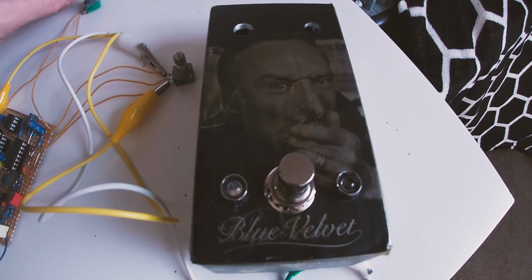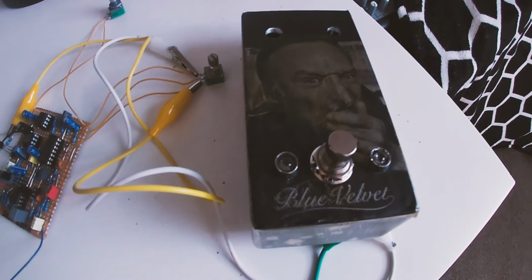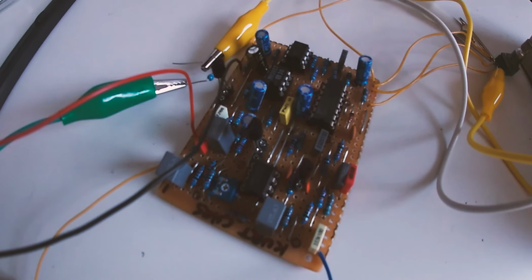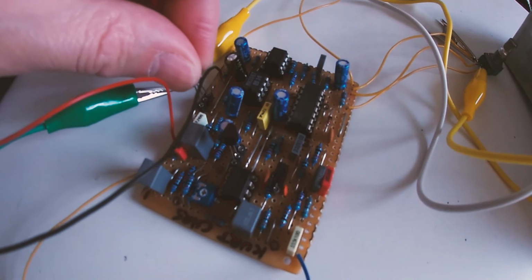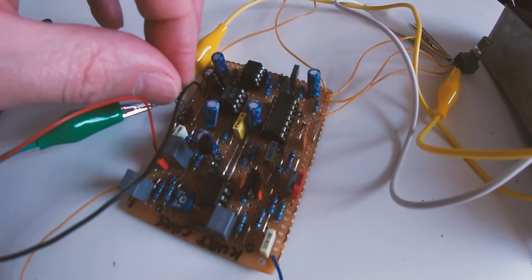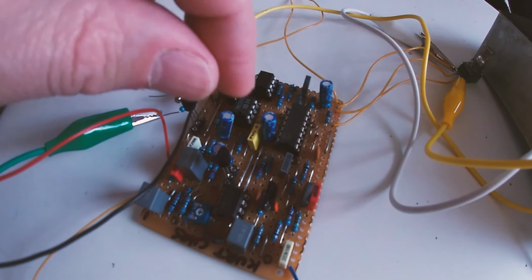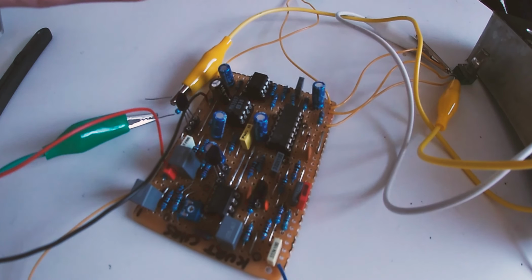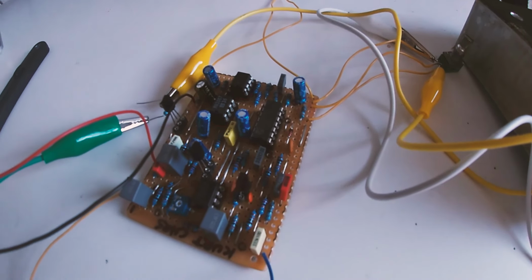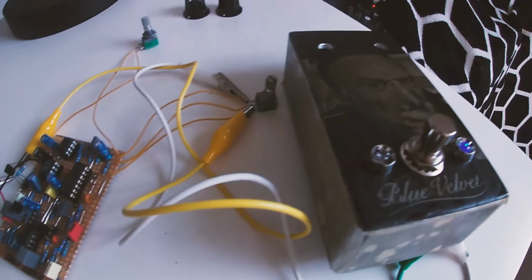So now I've got that all working, I'm happy to go and box this up. So yeah, that's my circuit. And that's going to go in there. I just need to trim down my transistor legs because I socket the transistors just in case they don't work or whatnot. So I'm just going to trim those legs down and solder them in a bit. And then get wiring up with some pots. And that'll be that.